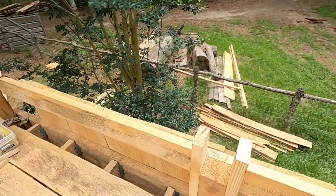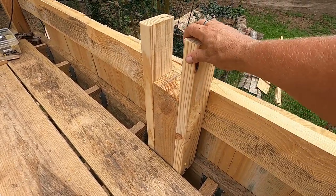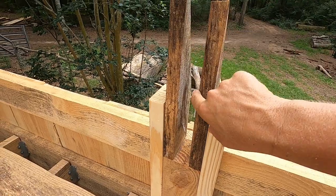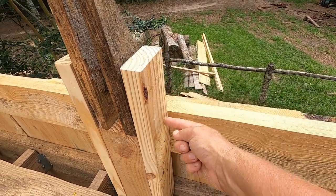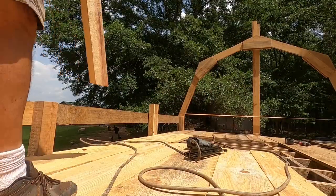While he's nailing that, I want to show you guys what I came up with to attach these rafters, because when I designed this building I never thought about how I was going to attach them. Here's a 4x4 — we nailed some 2x4s to the outside of it, they've got a lot of nails in them, they're not going anywhere. Then I've got some 1x4s that are going to go in here like this, and the rafter will sit in between there. Then we're going to put two lag bolts, top and bottom, through all of it. I think that's enough to hold it. I guess we'll find out the first time a hurricane comes through. I'm not a builder and I'm not a designer, so I find problems with my designs as I go and then I try to find a solution for it.